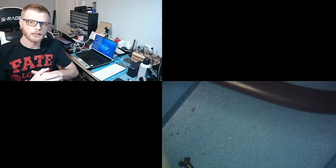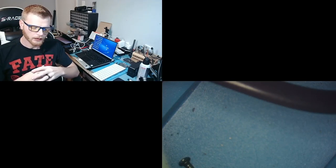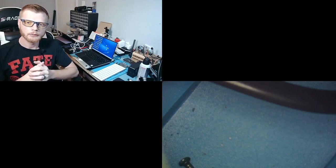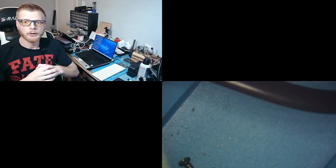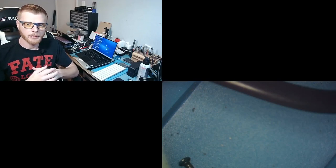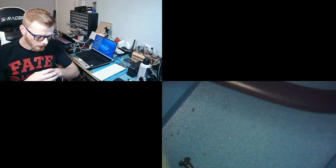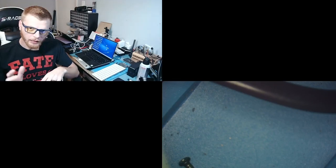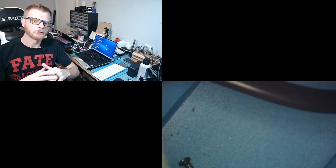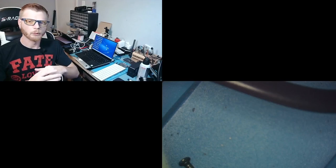It's almost 2 hours now to go through those three devices. We did an iPad Air 2 that had a main short, which also had a weird current draw. We went through a MacBook Air that had liquid damage on the SPI circuit. And then we had this iPhone 11 that had baseband issues, and we got them all working. The iPhone 11, at the very most, only needed a sandwich reball, because that wasn't perfect, but I do believe it's going to work the way it is.